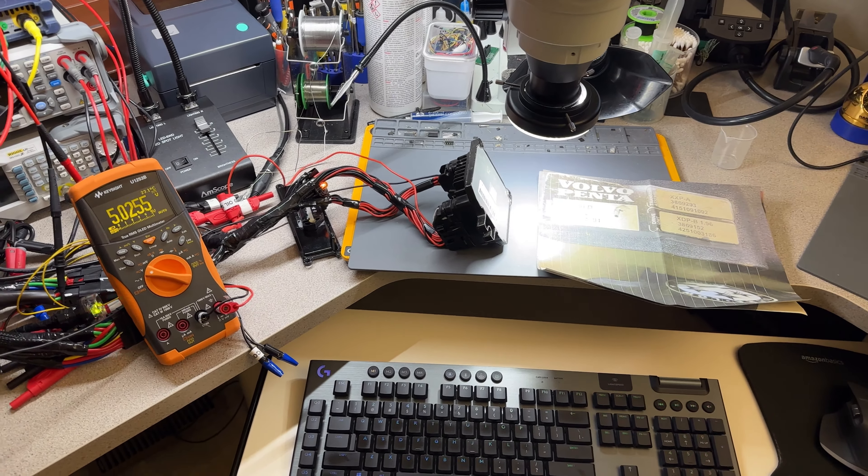The next test I did — I'm opening PicoScope. This is a test right at the microprocessor, at the IC that controls the actual signal coming from pin J2-16. It goes through a resistor, I think it's a 400 kilohm resistor, through another capacitor to ground. It has two protections — one right before the resistor and another after — it enters this IC and then sends the signal to the microprocessor. I was looking at these because I was getting a CKP signal fault that I didn't see in the history when I first connected the computer.